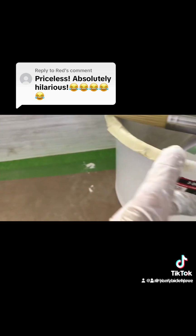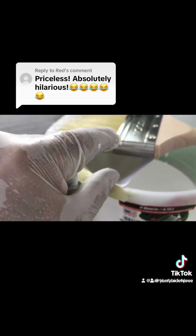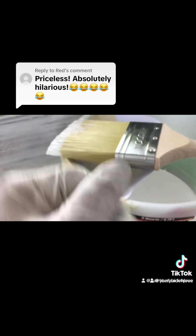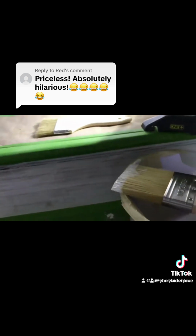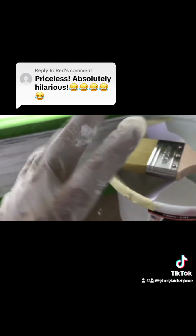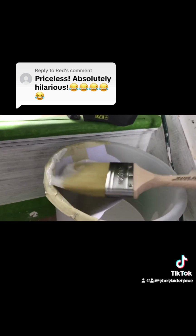And what you want to do is put a cap of, believe it or not, lamp oil. Good quality, just one cap. Then lift up your brush and see your flow. Lamp oil is better than Penetrol. It makes the lines lay really beautifully. Enameling is all about lines when you're brushing.